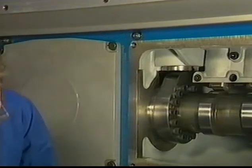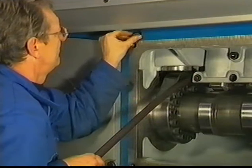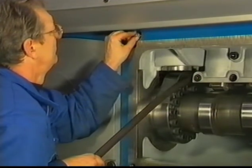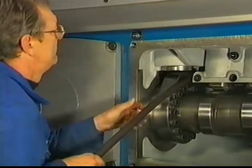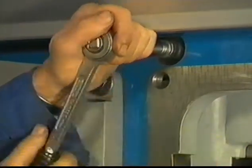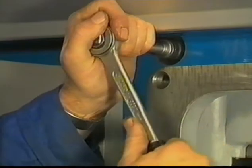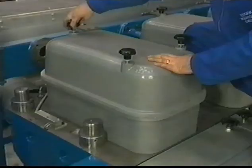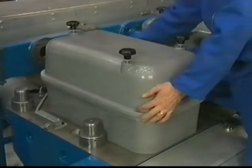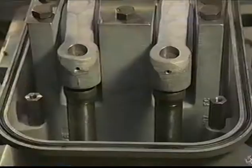Now the guide bush of the fuel roller has to be lifted, with a crowbar for instance. The locking pin has to be tightened completely. As a result, the fuel roller becomes free from the fuel cam. In order to lift the inlet and exhaust roller too, the push rods need to be removed. For that purpose, also remove the valve rocker arm support.